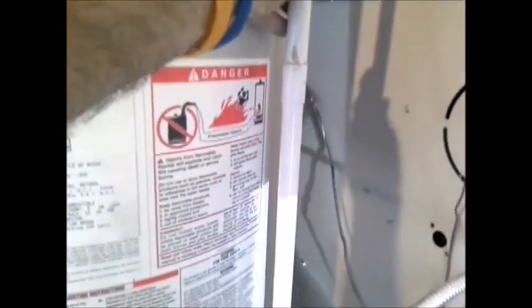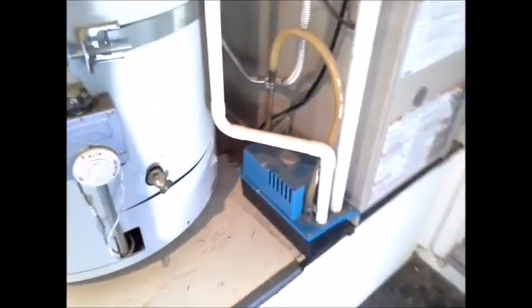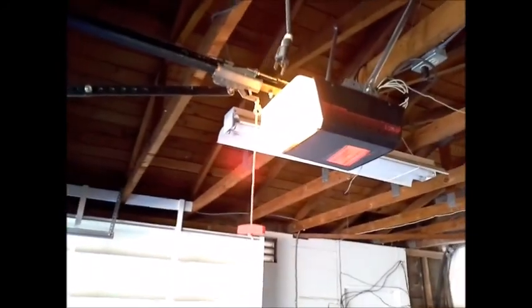And also in the water heater, this is a pressure release valve drain, and it drains into a pump, which we don't like to see. If there's kids in the family, especially babies, there are no secondary beam lights for your auto reverse for your garage door here. And there are a couple other items about the garage door that you'll see on the report. And then the opener did not self-close. So that's what you have there.